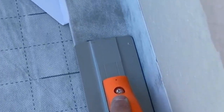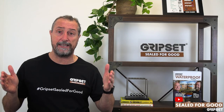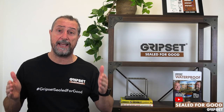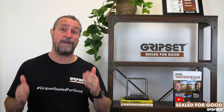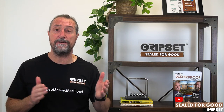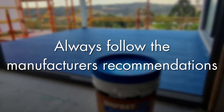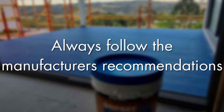When we talk about doorways, is the step-down to specification? Has that balcony been correctly constructed so you can have the right falls? And understanding that if tiles are going on there, for example, is there enough room for that? These are the details you need to follow, and always look back at the manufacturer's recommendations on the substrate or what the building code states.